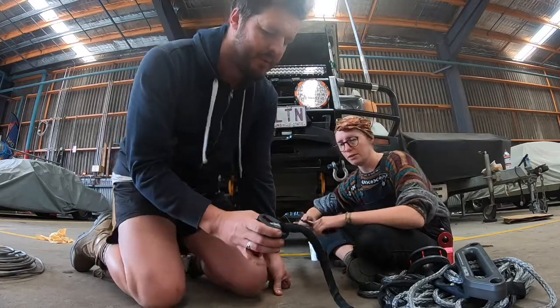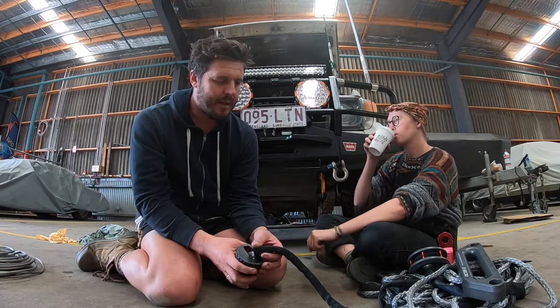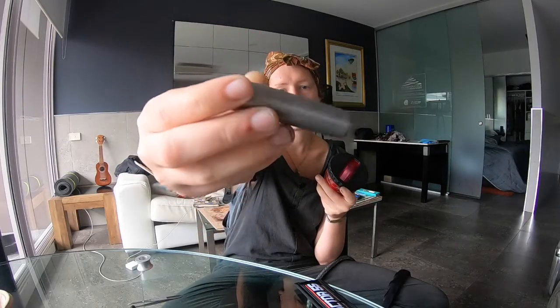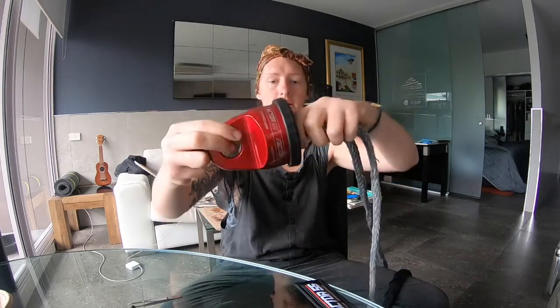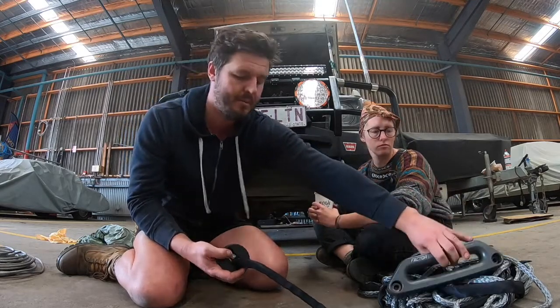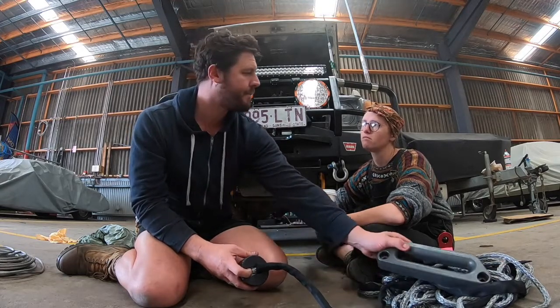There's one other thing — they have also done away with the traditional steel spool. This here has a titanium pin going through it and the load spool is just an aluminium load spool, but as you can see, it sits inside the Prolink. So there is nothing sticking out of here. The reason that's important is fairleads need to be nice and smooth, and this is all just fabric — the load spool is inside there.